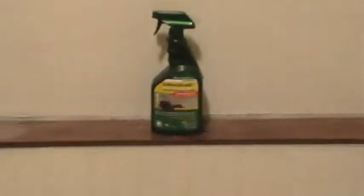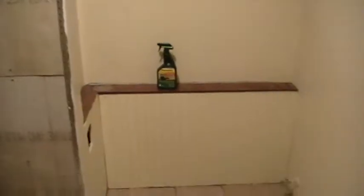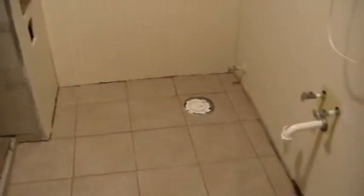I waited a couple of hours and wiped it down with a towel, and it came out pretty good. I did vacuum it. Now it's just time to put the sealer on — I'll be using this Safeguard stuff I still have from my other room. It's a grout sealer. You have to wait three days to do that.